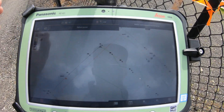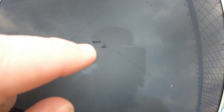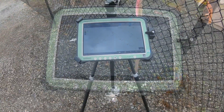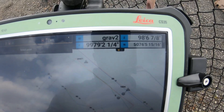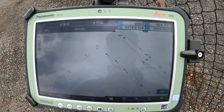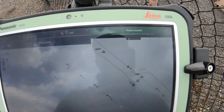Now I'm going to need to select my second point, as the menu at the top is telling me. I'm going to go over to grav two, which is our second survey point, and line up there as well. Now that I am lined up on grav two — shown at the top right — I'm going to hit 'start' and then 'store.' The point is stored.